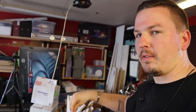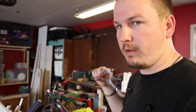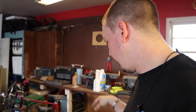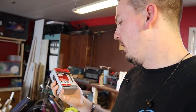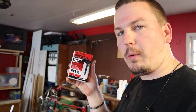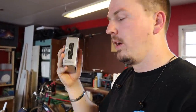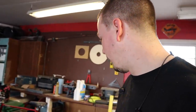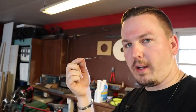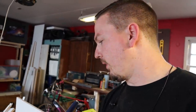This is half inch, obviously, so it's much thinner, so I gotta be very careful about what screws and size drill bit we pilot drill it with. We're gonna use number 6 drywall screws. They're not quite as big around, so that should help with splitting, and being drywall screws, they're a finer thread with a self-tapping tip, so much less likely to spread and split the wood. We are still, however, gonna pilot drill it with a nice small drill bit, whatever appropriate size.